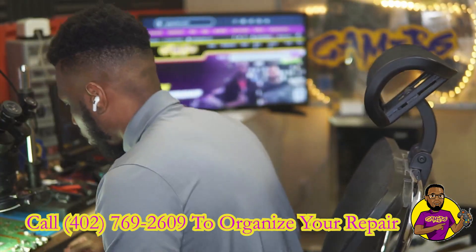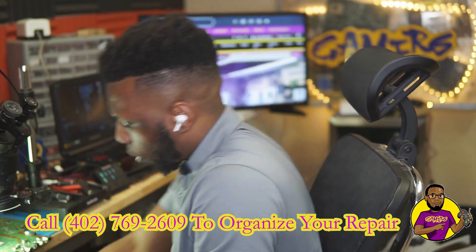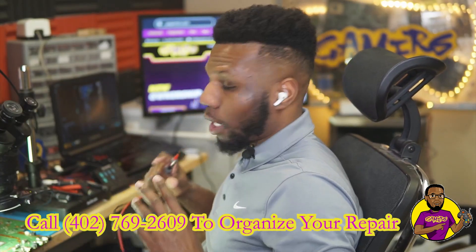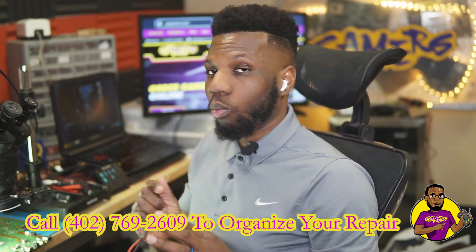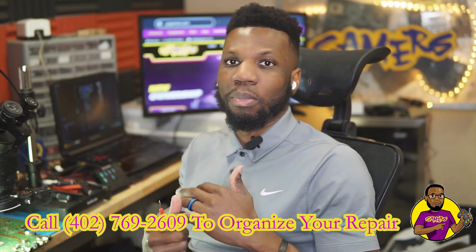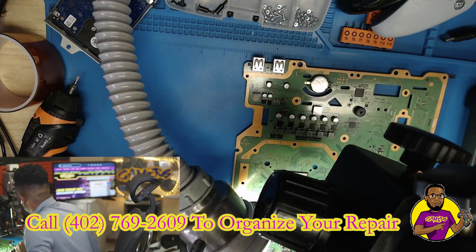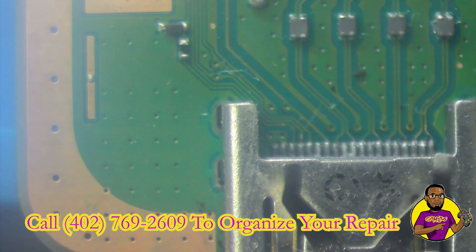Here's what we're going to do: I'm going to obviously replace the HDMI port, and then I'm going to replace the HDMI IC. Right now I'm going to take this regular standard cheap multimeter, put it into continuity mode, and then test out the EMI filters to see if I'm getting continuity between them - to make sure those traces underneath still work and aren't torn. I'm also going to make sure there are no cross links, because sometimes the coils inside can break if someone heats it up too much and it will bridge over.